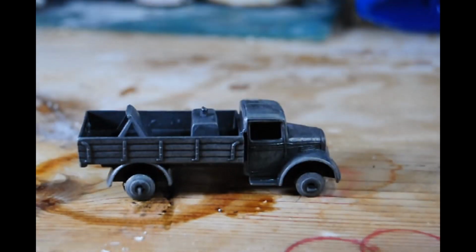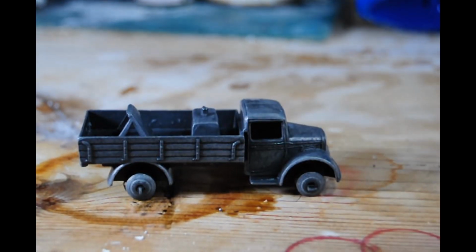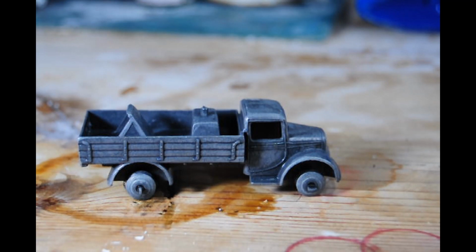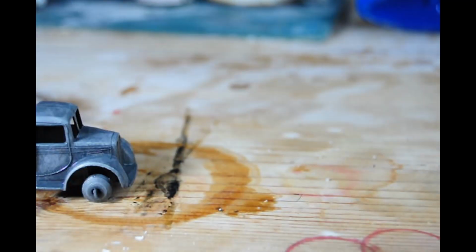And here comes the caustic soda bath of doom. Here we go. And there we are, a nice fizz. It was quite sedate, really. It was all paint, more than likely oxidised rather than stripped, because there were no real flakes of paint in the water. The water just changed colour. And here is the casting out of the water, showing it in its bare metal form.